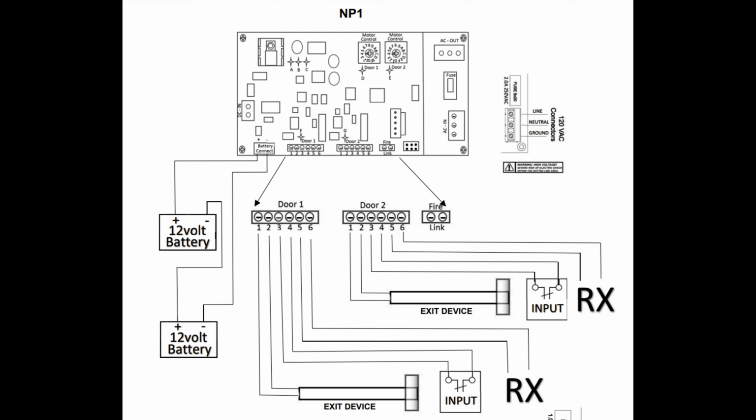I totally agree. You don't want to be sitting here trying to spec some type of a delayed egress fire exit push bar with an alarm on it, and you've got all these prefixes and suffixes, and you get 2 or 3 numbers wrong, and then you've got the complete wrong door hardware, and I don't even want to go down that road. Yeah, 55 and 57 by Sargent are 2 different animals. So yeah, you're right. That's for sure.